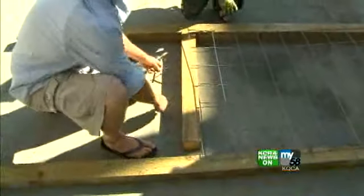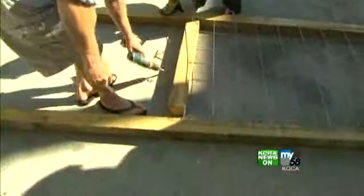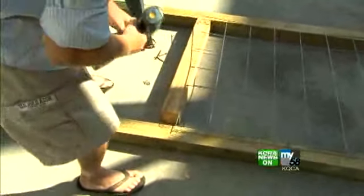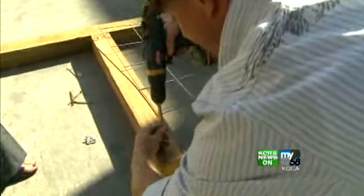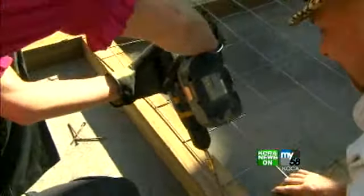I'm going to let you drill this in. What you're going to do is go at a 45° angle — we're doing a toenail. I'll get the first one started for you. You don't want to put these too close to the edge because you might split your wood. Go ahead and hold that up right there at a 45, then butt this in and line it up. Take the screw all the way in.